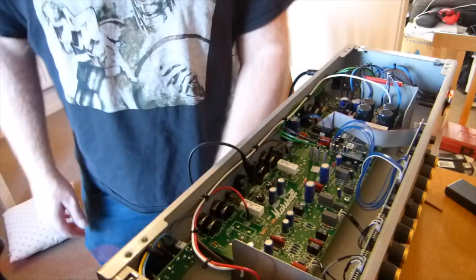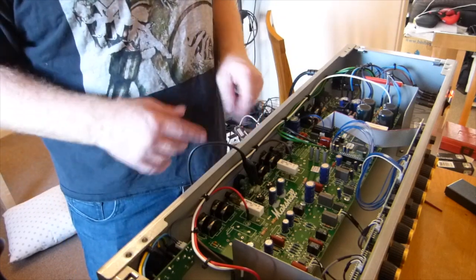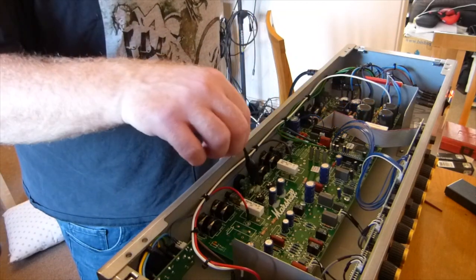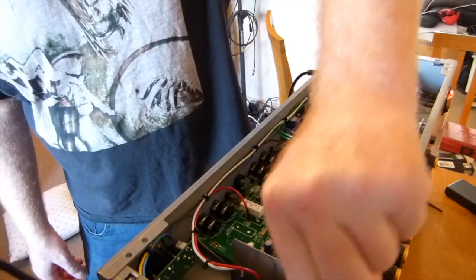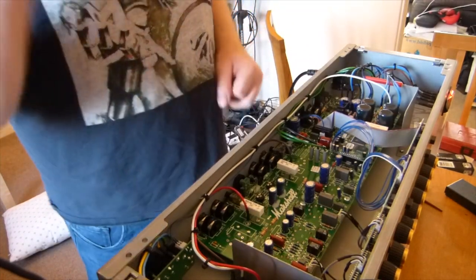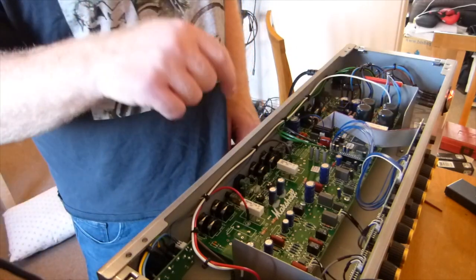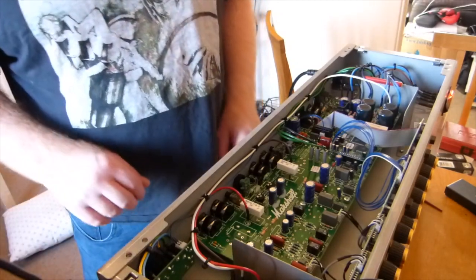So next thing I'm going to do is just check the plate voltage and see where that's at. And then do the little calculation to see what wattage we're running at, what percentage we're running at of max dissipation. I don't know if it would make any difference staying on the pin 3, but I've always done it off the chassis. I don't do the measurements for the bias. If you do from a chassis, it will be slightly different from if you do them from pin 3. So you definitely want to measure your bias voltages from there, it would seem.